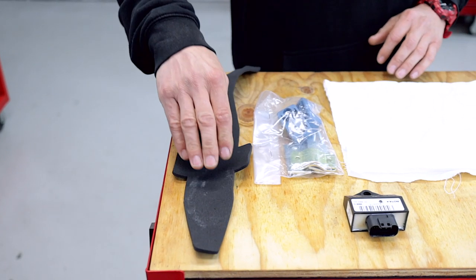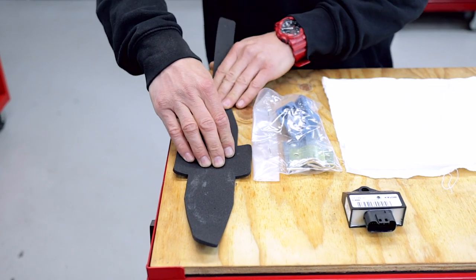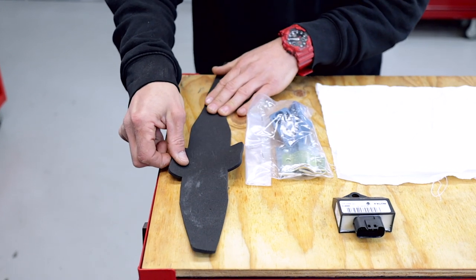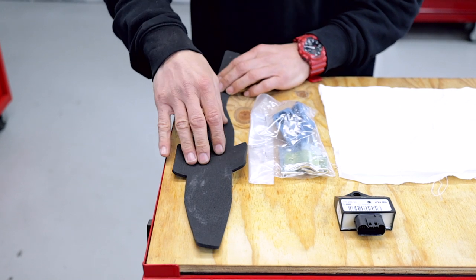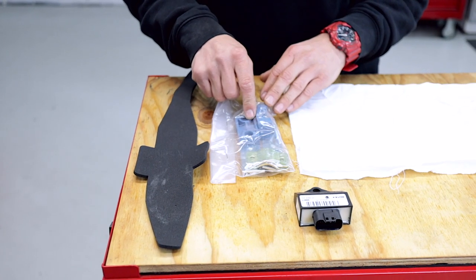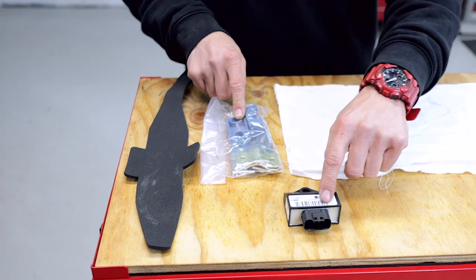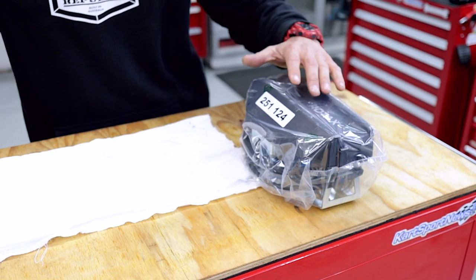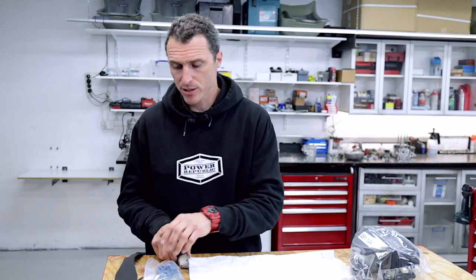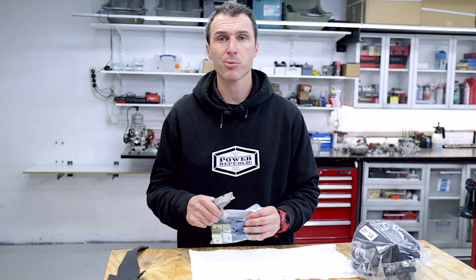So in the kit comes the battery mounting anti-vibration — it's just like a phone cradle and you sit the battery down inside it. These are the mounting kit for the battery bracket to the chassis. You've got the ECU computer, and over here we've got the battery bracket with all the harness attached to it. We have covered the Rotax Max engine assembly in another video series and you can click that link in the description below. Otherwise you're going to need to get your Stanley knife and break open all the packets.